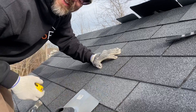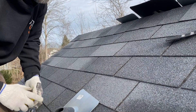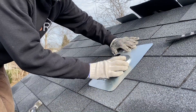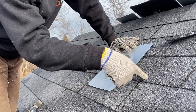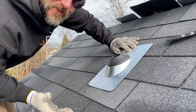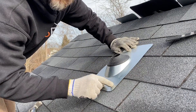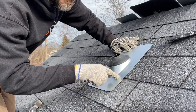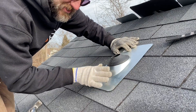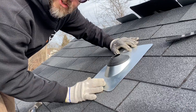We're installing this flange — the high efficiency PVC piping coming through is two inch. Got our locate screwed from underneath, got our hole popped. First thing you do is take your flange and set it on that center hole, then look at your shingles. This row and this row are going to go on top of the flange, and the flange is going to sit on top of this row — that's your proper water shedding install. If you just had one row on top you'd have a huge amount of flange exposed. Put this row on top and you're coming down just about to the bottom, which is correct. Put the row above that on top and you're gonna bury the entire flange — it's gonna drain out possibly on this shingle, but probably inside the house. So we're gonna have two rows on top and the bottom of the flange exposed, which is the proper install method.